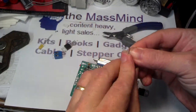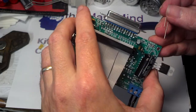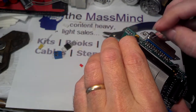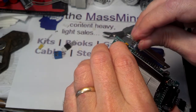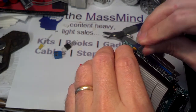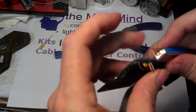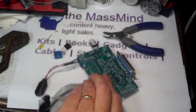The resistors on this board are soldered standing up, so we're just going to do it like this. I'm going to put this in on the bottom. It just goes in right here. Finally got it in — I was beginning to think I had filled that hole up with solder. If you ever do fill up a hole with solder while soldering in one component, you might accidentally fill in another component hole with solder when you don't intend to. I'll probably show you how to recover from that particular error in a minute.